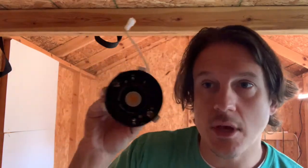So this is the 2-inch remodeler downlight. There's your chip set sitting right in here. What got me really excited about the 2-inch line was that not only did they introduce 2700K in a narrow beam, they did it in an adjustable. The adjustable is available all the way down to an 8-degree very narrow beam. Just to be clear, the very narrow beam is a separate chip set, so you can't swap out optics — if you go with a narrow beam, that's it, that's the 8-degree. From 15 degrees and up, the optics are interchangeable, so you can actually swap out and get different performances.